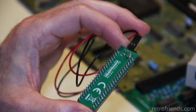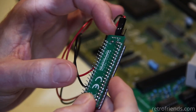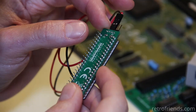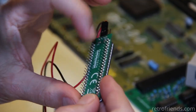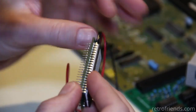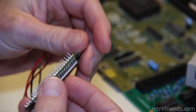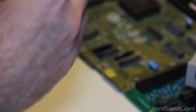You've seen them, they're all over eBay. There are four pins here but only two of them have a jumper. It looks like this is the right one - it pulls it down to ground. They've likely made this a big ground plane, and flipping the switch to the on position grounds that and also grounds pin one.